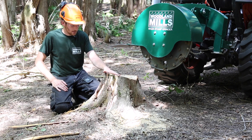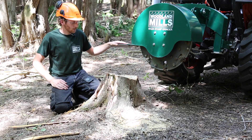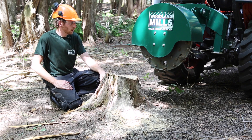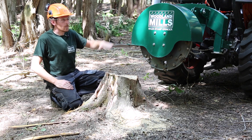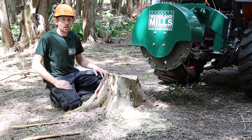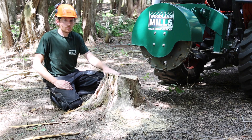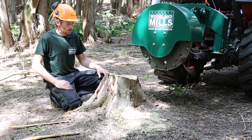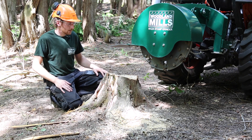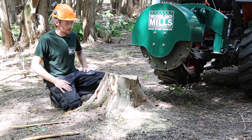The chips will be used on the trail, the poles will be used for fencing later on, but now I'm left with this stump right in the middle of the trail. I'm going to fire up the stump grinder. When I cut the tree down I kept it below 12 inches — when I raise the stump grinder all the way up with my three-point hitch it's about 12 inches off the ground, so keep that in mind. The lower you keep the stump to the ground, the less work you're doing with the grinder. I'll fire up the tractor and we'll start grinding down.